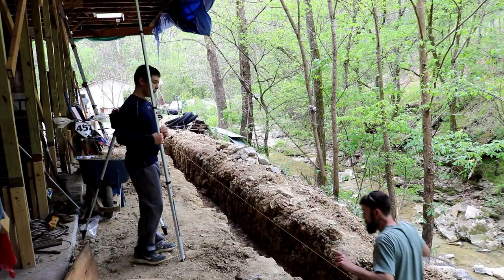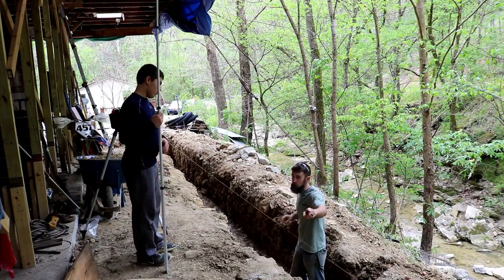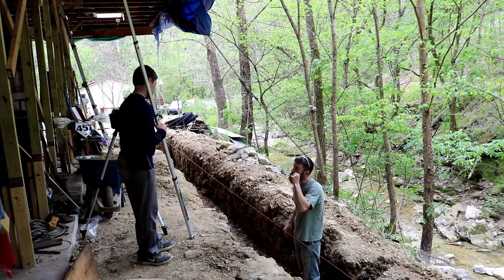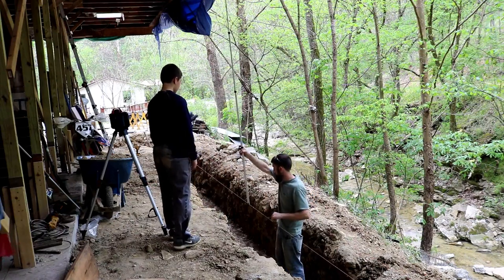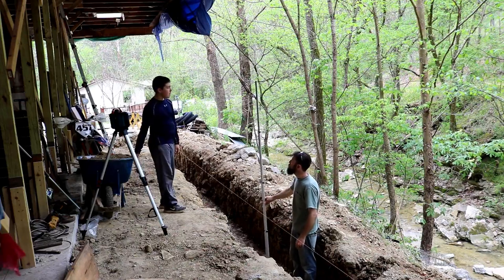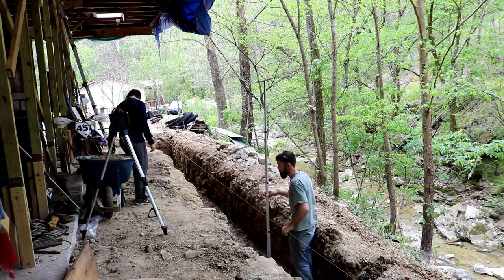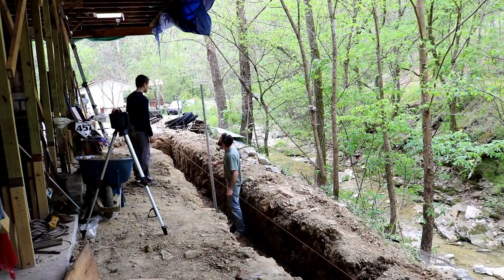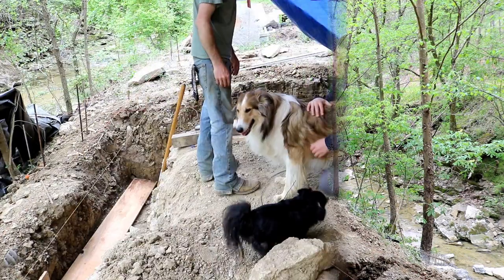Because we have a step in the foundation of two blocks, it needs to be 16 inches different from that spot up there. So that was 6 foot one, plus 16 is 7 foot five. Yeah, basically, right at the quarter of the five. So 7 foot five, that's good. 7 foot five and a quarter, so a quarter inch low. It varies some, as long as we're not above that. Seven five and a quarter.